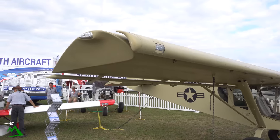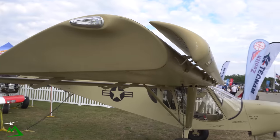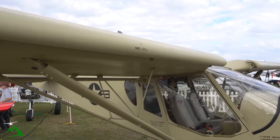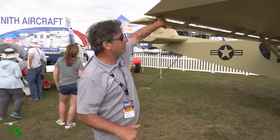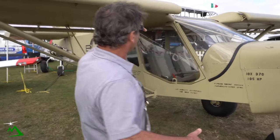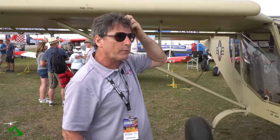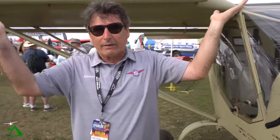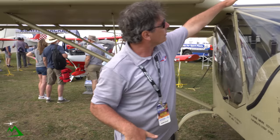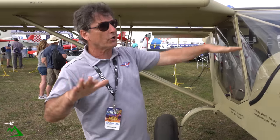Why don't you tell me about the design of the wing — it looks a little different above the cockpit. Well, the first thing you'll see is it's got a fixed leading edge slat on the front end, and it's also got a trailing edge flap — it's both aileron and flaps. It's a separate airfoil, so at very low speed you're getting fresh air blasting over your control surfaces. A lot of airplanes may have a low stall speed, but at low speeds the ailerons get very mushy. This allows you to still have full control. At the actual wing root, the wing comes basically into the cabin area. The wing sits above the cabin, which is important for visibility — you're not having to duck under the wing all the time. The wing is above your head, so it really gives good visibility, same thing in a turn. That's one of the reasons we cut back on the wing like that.